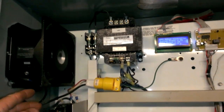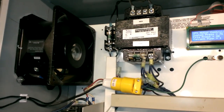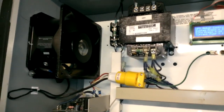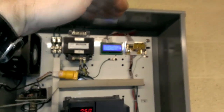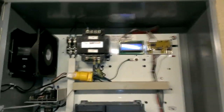I changed the fan setup. Somebody ordered this fan for something else — for cooling a cabinet space in a kitchen, or someone had a little reach-in. They said it was too loud, so I gave them the small one from here and put this monster one in here. Also, I took the original fan out from the top and put it on the side, because I realized if I ever get a leak in here, water sprays up and it'll roll right down into my VFD. I don't want that. So, fans are over there away from where the water is — water's not going to get in the VFD now. This is all beveled so it won't run in there.